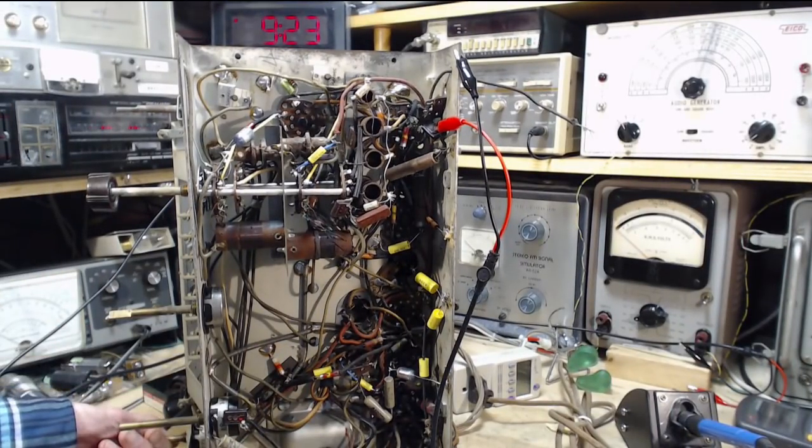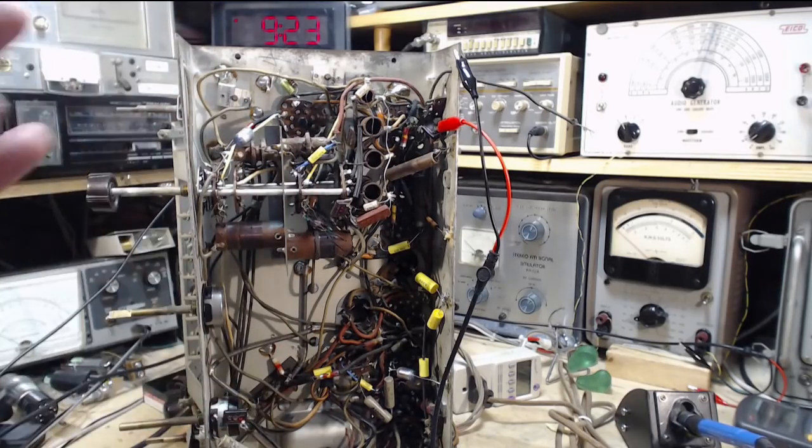Okay, here we go, volume down. Power on. Goodness knows, changing these capacitors in every case is having some incremental improvement effect on the radio. Maybe so tiny we could never notice it without a really careful measurement. At the same time, if the radio's been aligned with a bunch of bad capacitors and then you change all the capacitors, there's a chance the alignment is out because it was aligned with bad capacitors. Generally my experience is changing all these capacitors doesn't directly affect the alignment. Oh, don't quote me on that. Yeah, quote me. But make sure you let people know it's me.